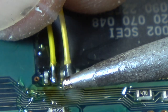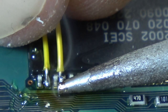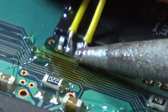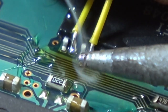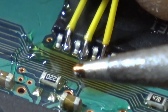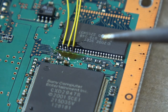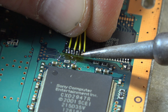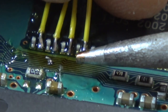The reason I'm hitting it multiple times is to get the best possible solder joint. With points this small, I like to just have a little bit of solder on the tip of the iron. In my last PS2 modding video I was using a tip with a little angle on it — I don't use that tip anymore because I lost it. I had to adapt to this tip, but it works great and it's small enough while still retaining enough heat.